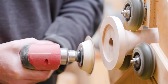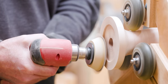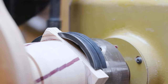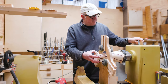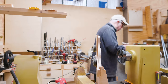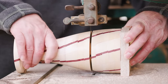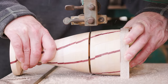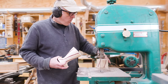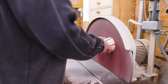Then I sanded the top, which was really small so it went really fast. Then it's mostly done — I can open up the steady. This piece is right about the limit of how big the steady will work with. Then I cut the bottom off on the bandsaw using the slot I cut with the parting tool. This doesn't really have to be perfect; I just need to not hit the part I don't want to cut. Then I can sand the bottom flat on the disc sander.